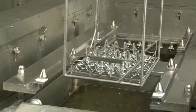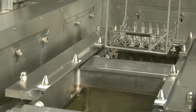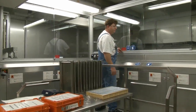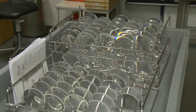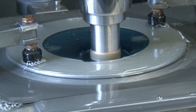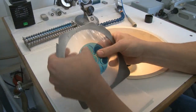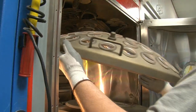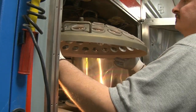The jiggling you can see is because the machine is so sensitive it picks up fluctuations in the warm air around the lens. Those blanks from earlier — this is what they look like now. There is more washing of the lenses in water and alcohol. If you're ever washing your binoculars or scope, try to do it in deionised water — with tap water, the acids attack the coating and the calcium clogs them up. There is also reticle making, where the cross hairs are applied in the dark room and the discs of polished glass with reticles on are cut out.